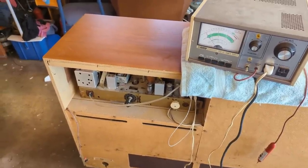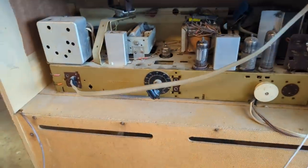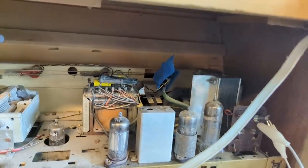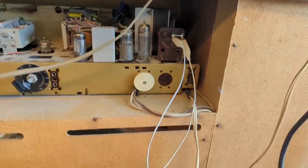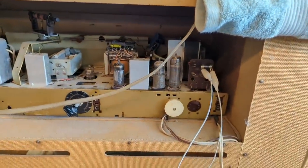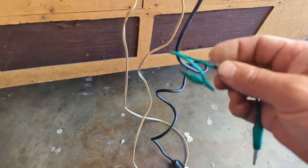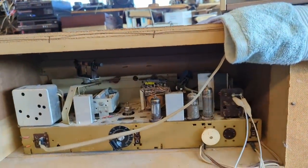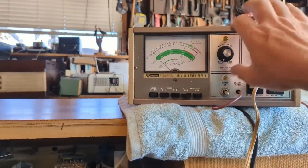Now I have the chassis back in the cabinet and I have a confession to make. I initially tried this out and the socket for the eye tube, essentially unbeknownst to me stupidly, was touching the chassis. When I test fired it with a tiny little clip lead - because for some reason this is still not making good contact - I fired it up thinking oh it's going to work. And what happened is that this acted like a fuse - it filled the garage with smoke. After realizing my foolish mistake and wondering if I destroyed the radio because I could have taken out the power transformer, I brought it up slowly like an adult.